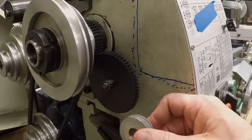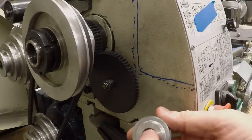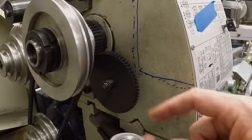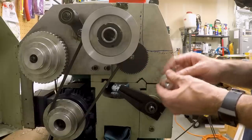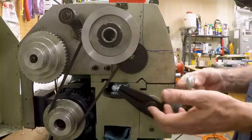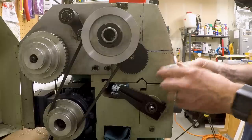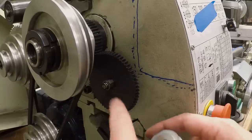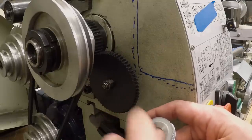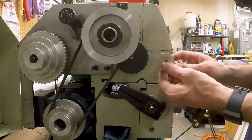To get power off of this shaft to the encoder, I ordered a GT2 pulley with a 16 millimeter bore, thinking I would just cut a keyway in it and fit it on this shaft. The problem is it's not a 16 millimeter shaft — it's actually a 14 millimeter shaft. I had measured it at some point and then ordered the wrong thing. I've got 16 millimeter bore pulleys to go on a 14 millimeter shaft. I thought about trying to sleeve them, but the sleeve would only be one millimeter thick and the key would penetrate all the way through, so I just ordered another pulley with the correct bore.